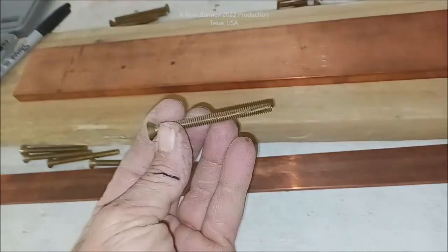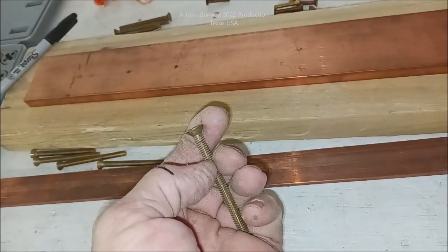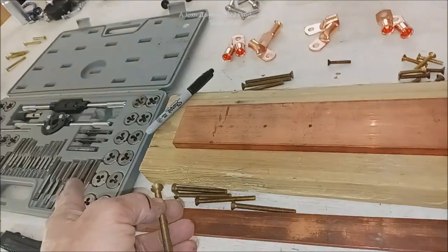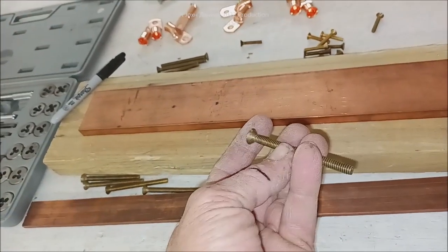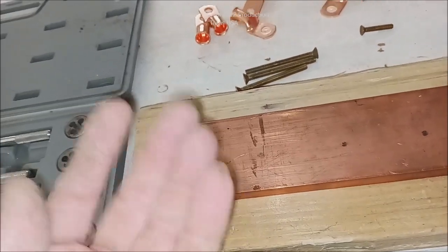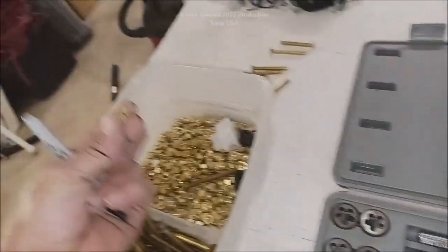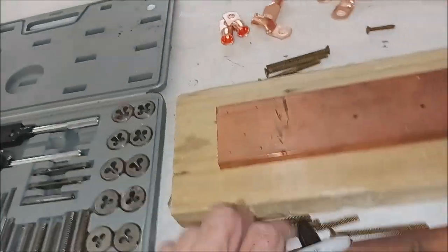What I've got here is these bolts - they're going to come up through the bottom, they will be tapped and come in. There's the tap set right there. They'll be tapped and coming in, and the five-eighths will go underneath it with bolts coming up through it. These will just be holes, and then we'll just take these and slide the copper that we're going to be clamping inside of that, and it clamps it with mechanical pressure.